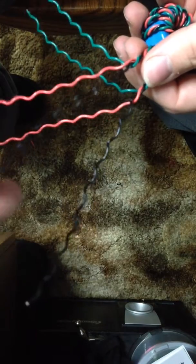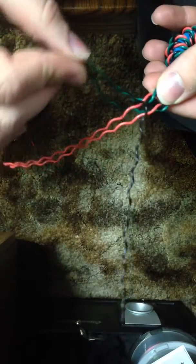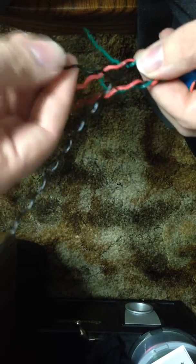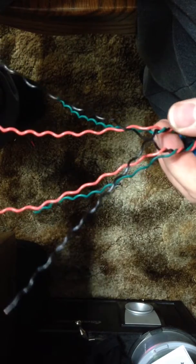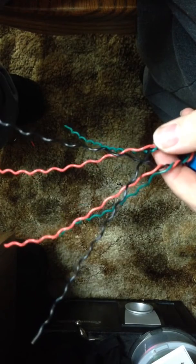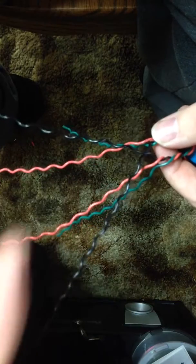For the anti-phase one, you simply switch them — bend one wire over there and the other one over here, so they cross. They're not really twisted, just bent together a little bit so they cross and will be together that way. All of these will be our positives, all these will be our negatives. Now we just label them. The reason why we label them is we must twist these leads again, and if we don't label them it's real hard to tell which one is on which side. A little piece of tape at the end is all we need.